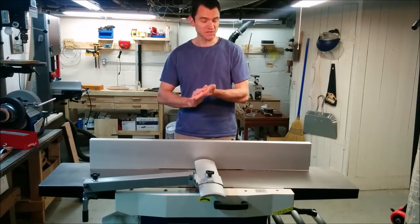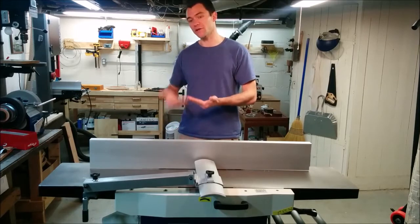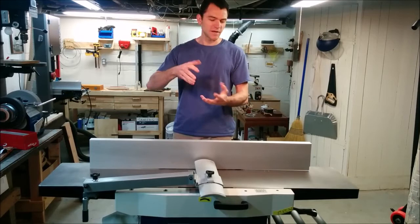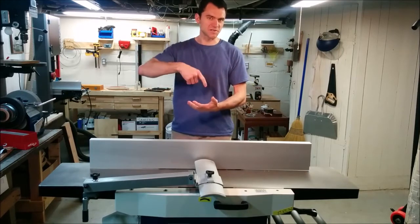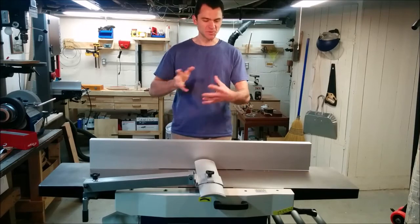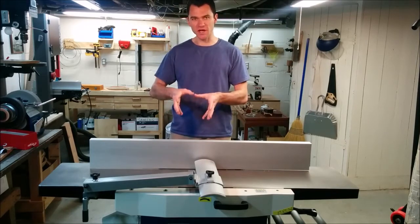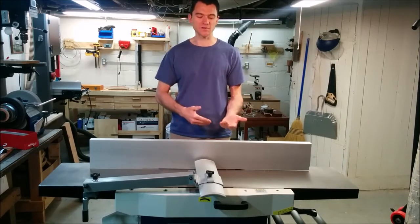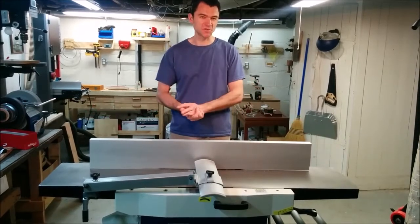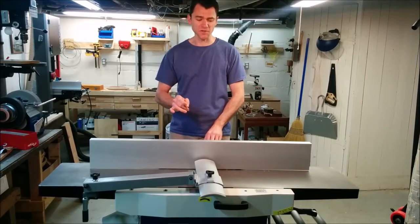Secondly, you'll hear this later on in the video when I'm operating the planer table. The main shaft for the planer table just rubs a little bit against its housing, so it squeaks. I had respread some of the grease around there up and down the shaft just to make it not squeak, but it came back, so apparently I need to re-lubricate that. That's probably something that should have been perfectly done from the factory.